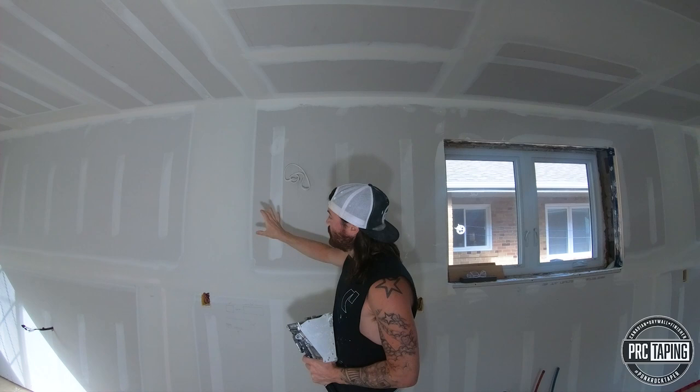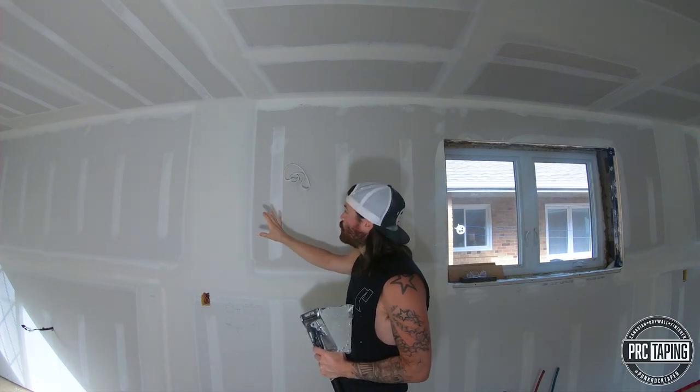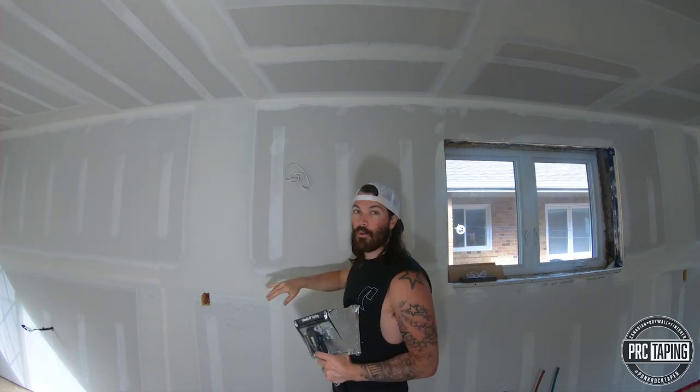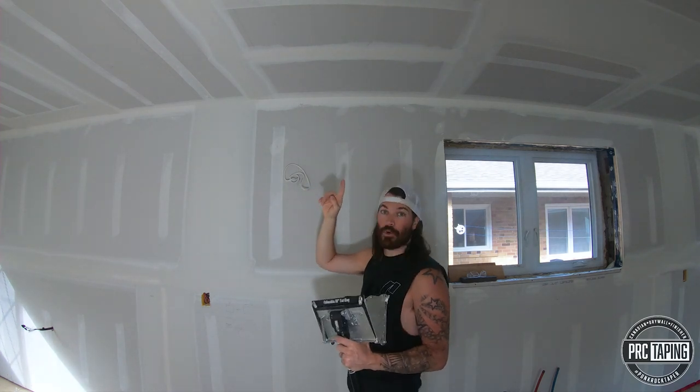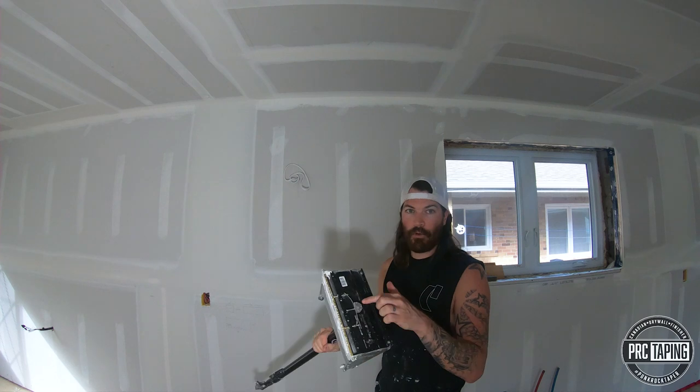You can see this one, I've already done it. I basically tagged — I call it tagging — each side of the joint. And then you coat the middle right away while it's still damp so that you're not cutting into the mud. So here we go, I'll show you on this joint above me.